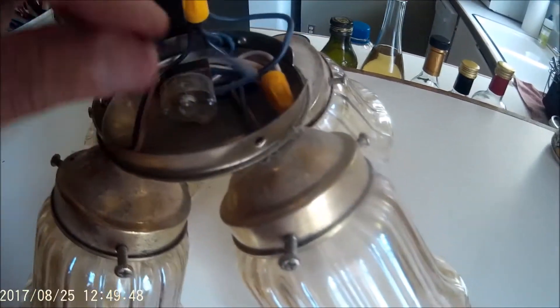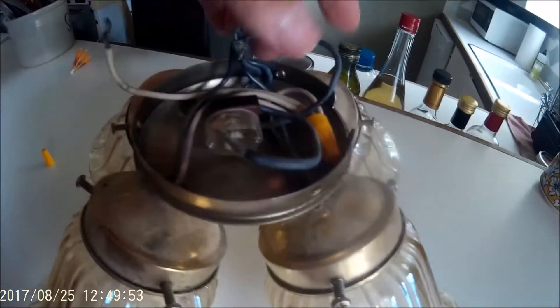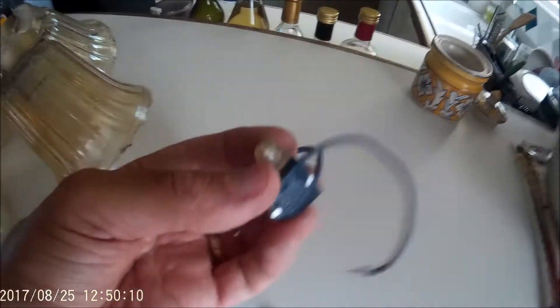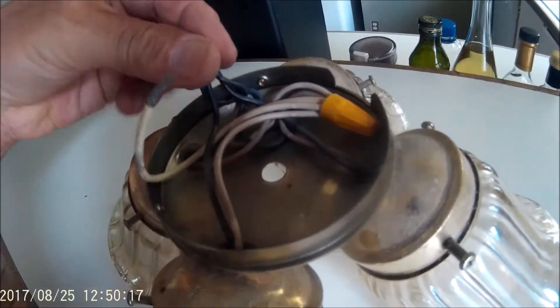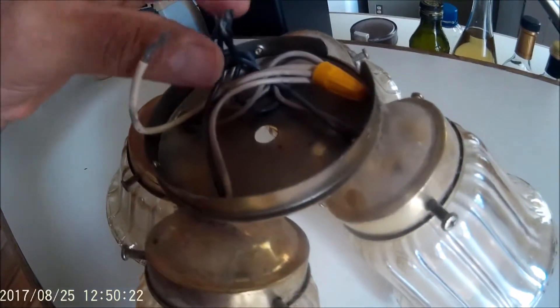The neutral — the white wire — goes to the neutral, and the black wire goes to the hot. We're going to disconnect this and unscrew the light; it's got a little nut. We're going to bypass the switch and hook the power directly in — black goes directly to here and white goes to there — so when you actuate the wall switch it lights up.